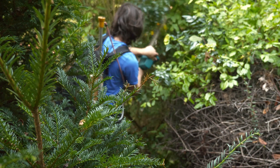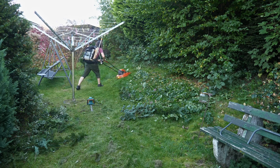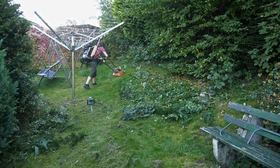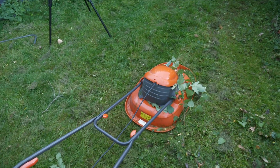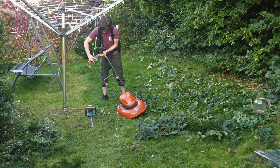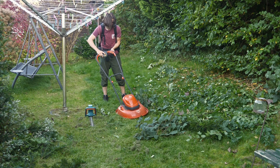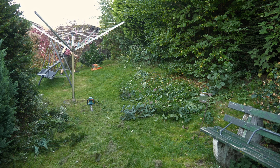The capacity of the two batteries in parallel provides enough power to run the hedge trimmers for over an hour and the hovercraft lawnmower for about 45 minutes. Since the mower is rated for 1400 watts I need to start it without any load by tipping it to the side. Once it's running, the batteries work hard with the cooling fans turning on, but they were able to keep up. This is cool — I can swoosh through the garden without dealing with extension cords.